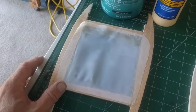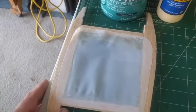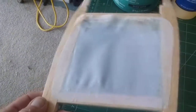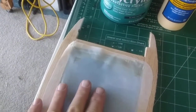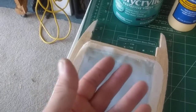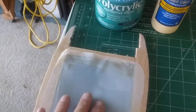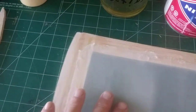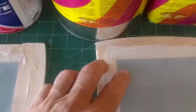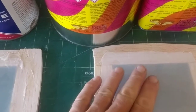The fabric shrunk quite well, however it didn't shrink as well as the other fabrics made for airplanes. The polycrylic brought this very soft, pliable polyester — as you saw in the other video — to a state similar to where the Sig was when I didn't put the butyrate on. The uncertified light was the stiffest, the Sig was medium, and the polyester was the softest.